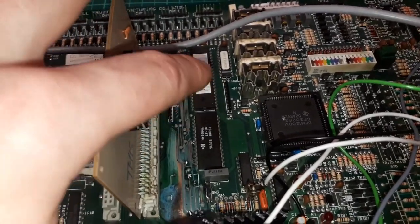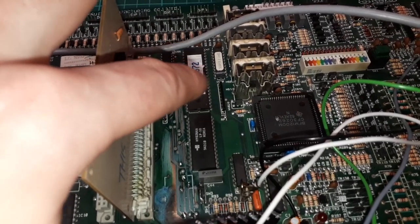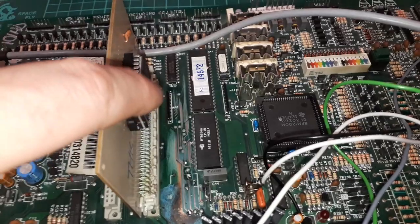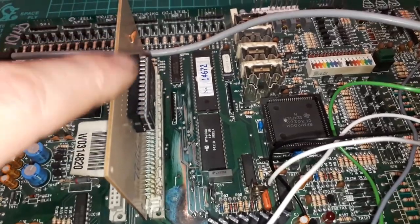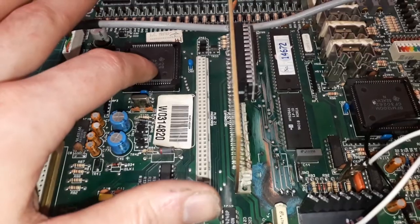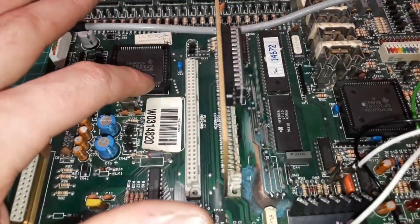But some of the ROMs, some of the address bus connections that are there, I'll buzz to there, but you'll find when you're trying to buzz out, they won't buzz to there. They'll buzz to different places. Some of them will buzz to here. And some of the standard address lines will buzz to there.